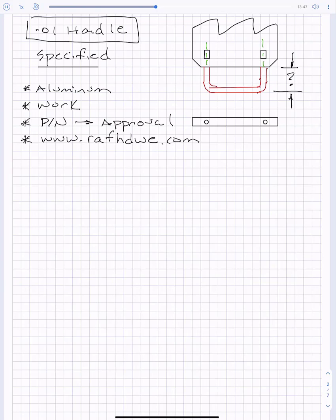The other thing you'll have to decide is what diameter the handle is going to be. And so if you choose a real small diameter handle, then it's going to be easy to break off, and I'm going to say that's too small. Then if you come back and say, well, let's make one that's got a nice big handle so it doesn't break, I'm going to say that's too big, and it's not going to sit flat. The assembly won't sit flat on the table. So the diameter of the handle is going to be correctly sized.